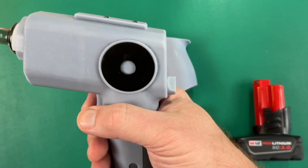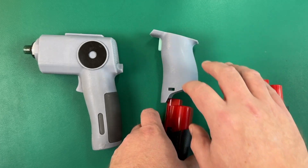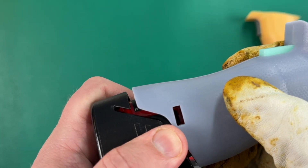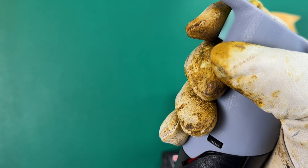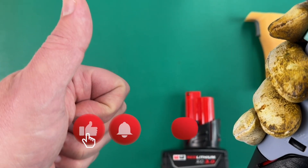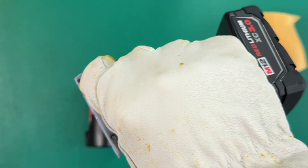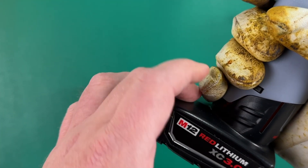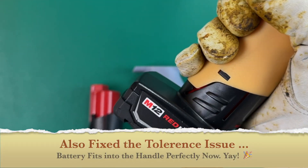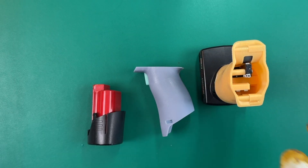I've built out this sectional print so that I don't have to build an entire device in order to test the feeling of the handle and the tolerances — you can see I actually have the connector in there. The idea is to be able to test this out rapidly without having to build the entire device, and I've already learned quite a bit from just doing this sectional print. Testing it with the CP battery, I find that it's difficult to get it on. The CP battery is comfortable to hold, but I'm already seeing some problems with the button that I've redesigned — that's an entire video in and of itself. While the CP battery had a good feel, the XC felt a bit cramped. I have big hands, but I can feel it here and it also feels a little cramped in the pinky. I've made the handle on this sectional print 5mm longer to have more roominess, and I've also made the button longer. You can already see this is starting to shape up really nicely.